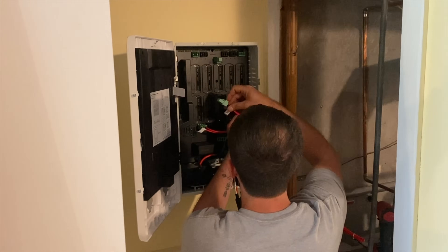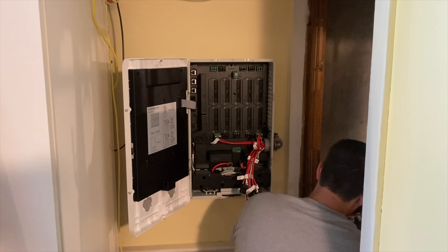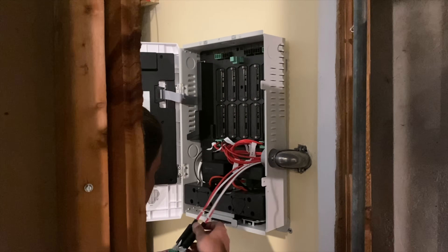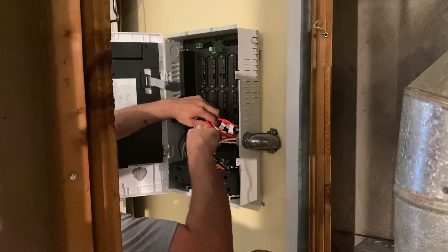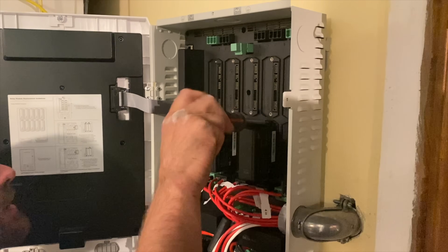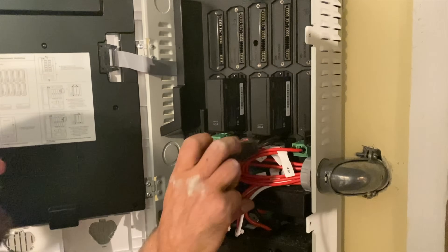Now we needed to make the electrical connections to the existing circuit breaker panel. You've got red and black wires — this panel gets wired in line with your existing circuits. The red wires come from your existing circuit breaker panel and the black wires go back to the panel, completing the circuit. Because you can have either 20 or 30 amp circuits, there's a different relay module for each, and EcoFlow includes both in the kit so the electrician installs the appropriate module into each circuit slot.